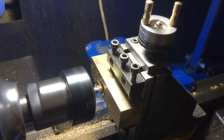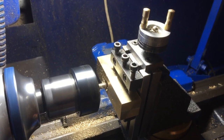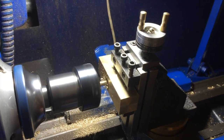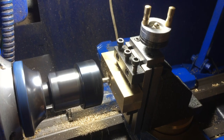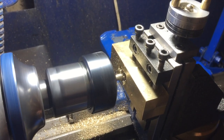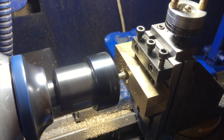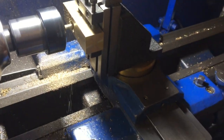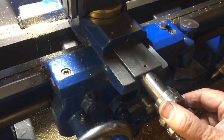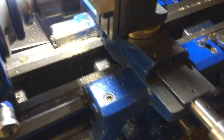I'm not using a climbing rotation but rather one that's undercutting as it moves along. In a climbing motion, the milling tool operates like the wheel of a car rolling along the surface you're cutting — it can roll up and drive over the top of a bump. It's better to have it turn in the opposite direction so that it's undercutting the slot that you're machining.